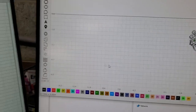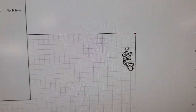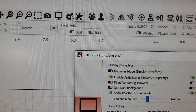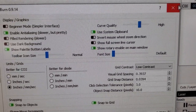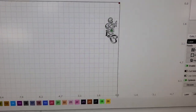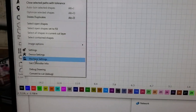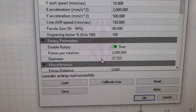Another thing — in his video he showed, underneath the gear settings, 'Show Rotary Enabled on Main.' When you are using your rotary, enable it, because it actually does pull that information. Even though it's still sending through the Y-axis, it still uses those rotary parameters.